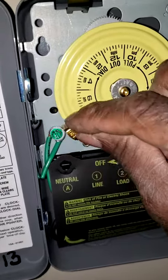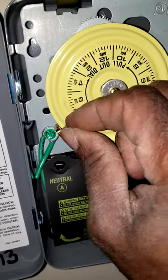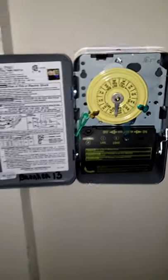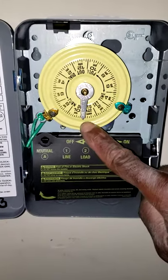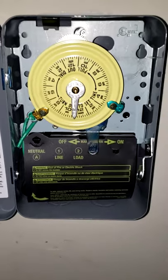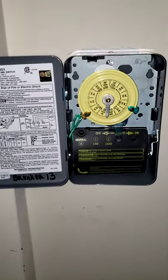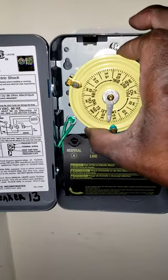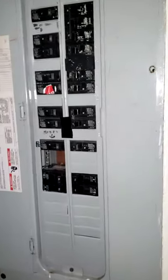This is the most important piece of the timer outside of setting the clock. Most of the time when a timer isn't working in one of these commercial buildings, it's because the time is not set correctly — indicated by this pointer. You're going to have to change it when the power actually gets turned on at the building. The only thing you need to do is set it for whatever actual time it is when the power is turned on at the building from this electrical panel.